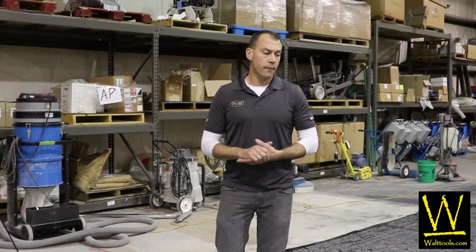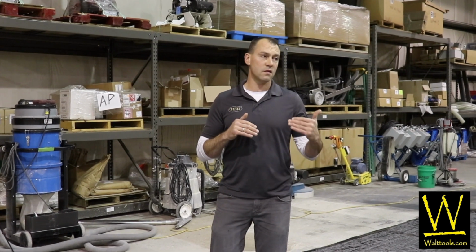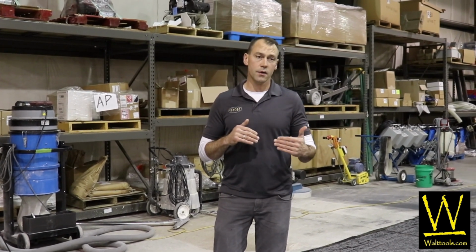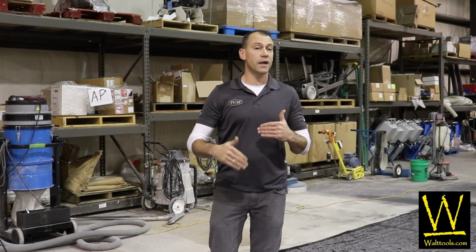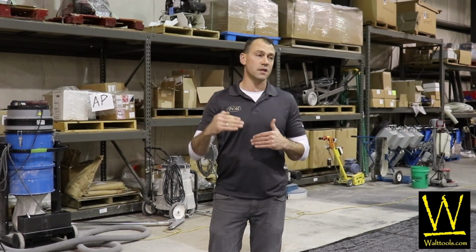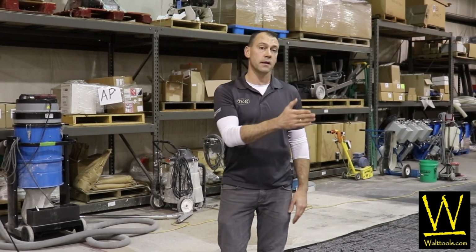It's all gone now, but I did a white base and I had roller lines in it that weren't lines as far as profile change. It was actually, you could see the concrete below the thin layer of white because it was such a light color. You could actually see the lines of the darker concrete underneath that. That translated right through another 7 mils of white resin and through a quartz. You could actually, with light on, see those lines.